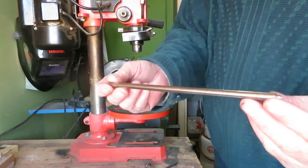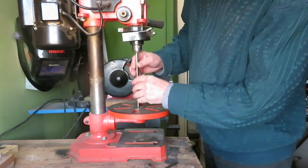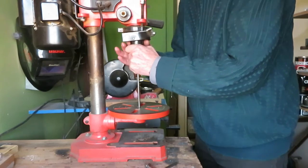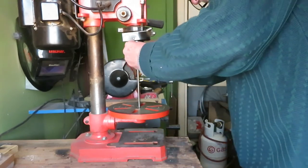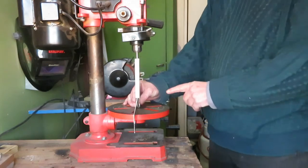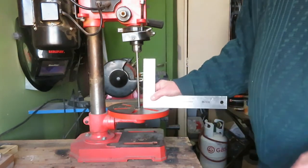What we will use is a stainless steel bar — in this case I took it off an old printer. The bar is very straight. We put it in the chuck as if it was a bit, tighten it well, then we put the square against it to verify if there's any deviation. We put it on the Y axis and we put it on the Z axis.